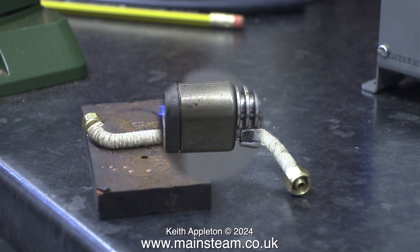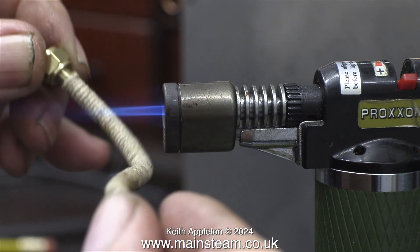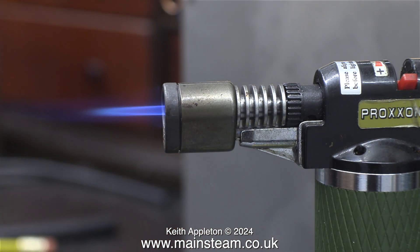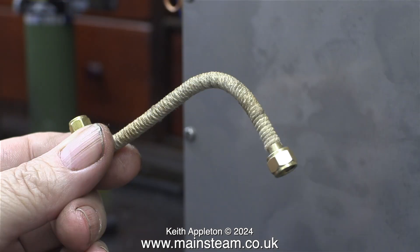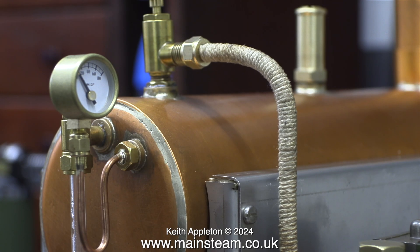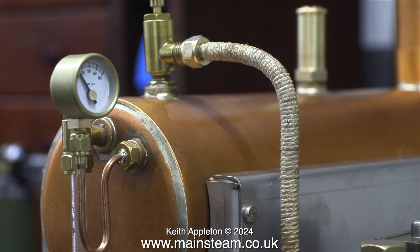The job's nearly done but the string is a bit hairy. Here I'm quickly introducing the lagging to the flame on my blowtorch — needless to say make this a quick job; you don't want to burn the string. This shows the pipe after it's been through the flame and it's a lot better. You can actually paint this string using some white paint, but the paint doesn't stay white for long at the high temperature. I'm just checking that the pipe lines up perfectly with the boiler tap, and indeed it does.